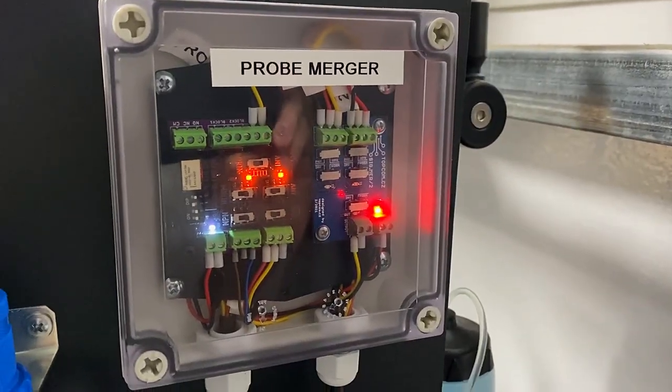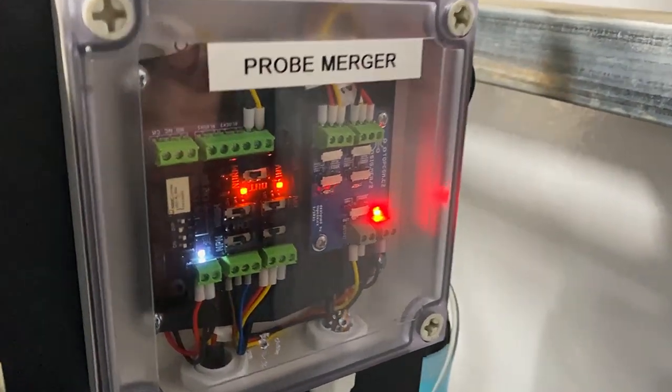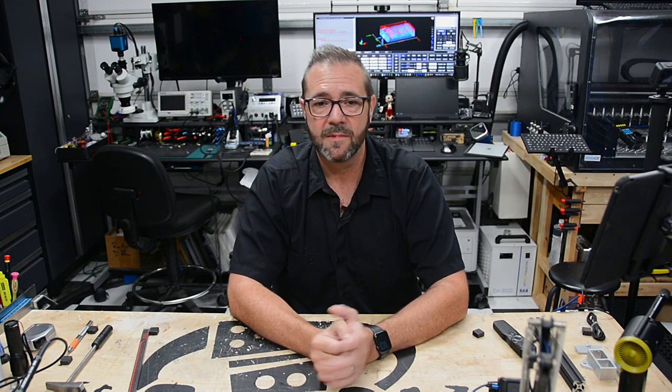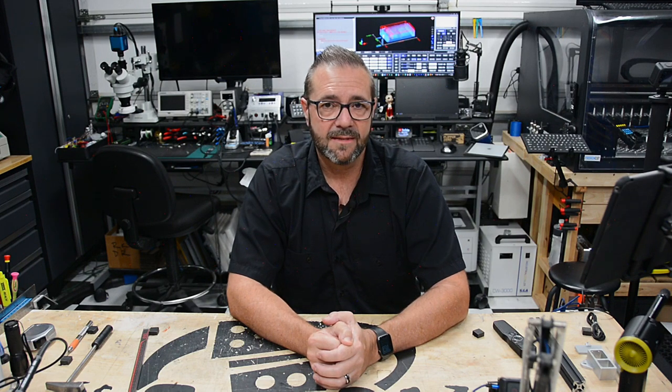They also have safety, which, although UCCNC has a jog safe probing, which stops the machine if the probe signal goes high when a jog or rapid is in place, will prevent you from crashing your probe and breaking the tip off and just all bad things. So that said, the signal merger, the mobile probe, the 3D probe from topcom.cz, go check them out. They also sell lots of adapters and different length probes, ruby tipped probes as you see on mine, that will get you more reach out of the tool, if you will.